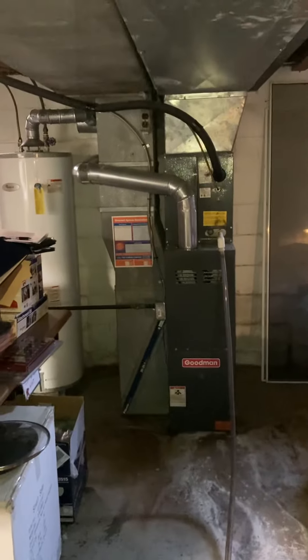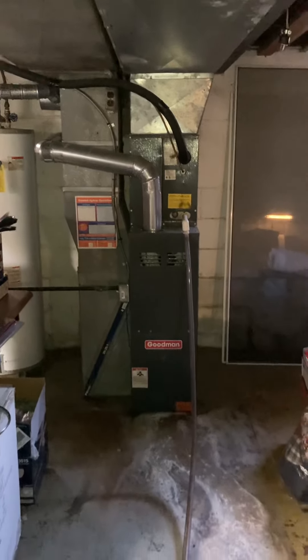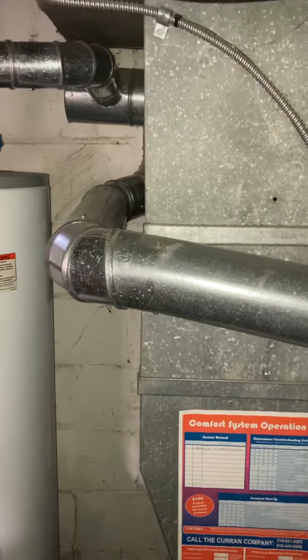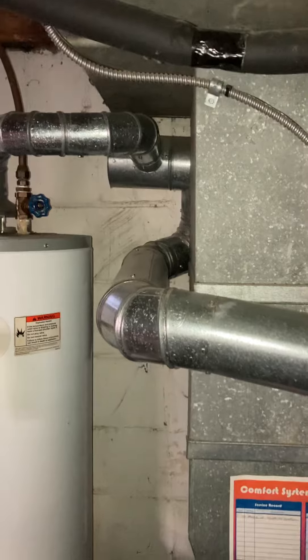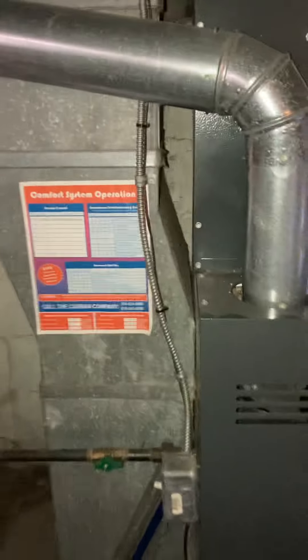Back over to the equipment — we've set up for 80% efficiency. There's a five-inch flue coming down; it looks like a liner has been dropped down the chimney. We've got good room. On that return side, we've got the flue coming out, with a T where three inches go into the water heater and then four-inch coming back to the furnace. It's kind of busy on this left side, and there's a little bit of an offset going on with the current return drop.